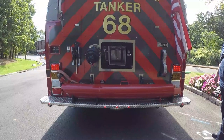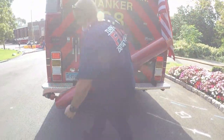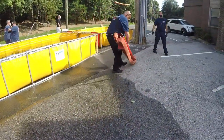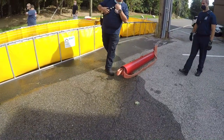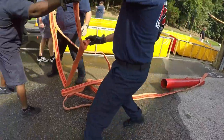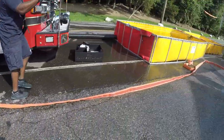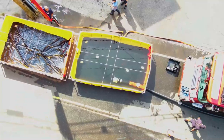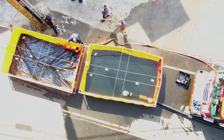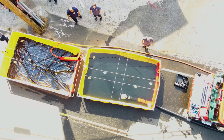Stanford's tankers carry these devices on their rear bumpers, packed with a 50-foot section of 2-inch hose ready to be connected to a discharge on the pump. Keep in mind to connect this hose on the same side of the pumper that will not be in a traffic lane. It's also good practice to set this device up on the opposite corner from the strainer to keep turbulent water away from the strainer when the transfer process begins. The Holi tube itself has a built-in low-level jet siphon maximizing the water transferred from the tank. It simply rests on the bottom of the tank and top rail, with no need to lash it down like with other hard suction methods.